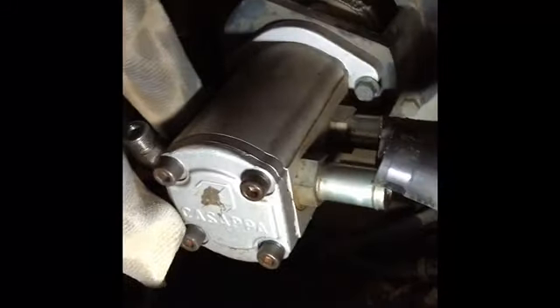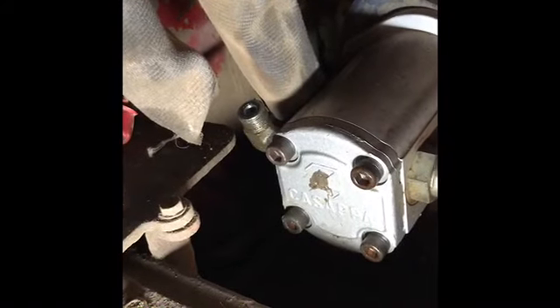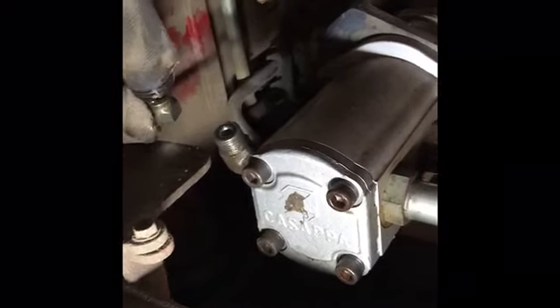Then come in to your front hydraulic pump — there are four hydraulic lines that come off this pump and you're going to remove all four of them. The black ones are held on with a metal band; go ahead and disconnect those and pry them away. The two on the other side are removed with an inch and an eighth wrench. A little hydraulic oil is going to come out, so you might want to get some paper towels to collect that.